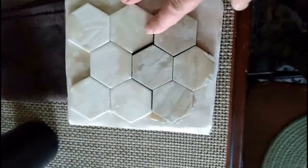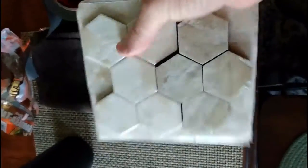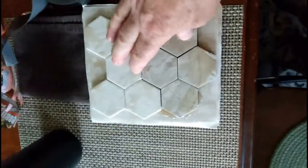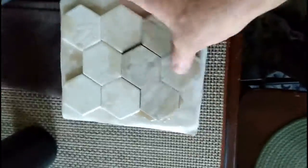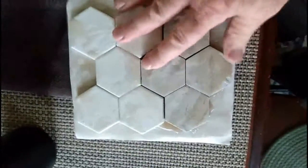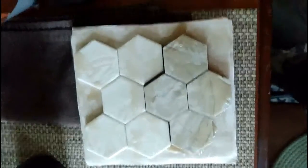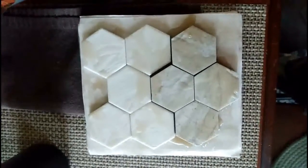So here it is. This test plate now has 45 layers of ultra-high molecular weight polyethylene sheeting on it, and I've attached two sets of tile for test purposes. The top one is 6-millimeter thick ceramic tile, and these are 8-millimeter thick. They're also soaked well in fiberglass resin to try and keep the whole thing solid and together. I'm now going to wrap this whole thing up really well with gorilla tape, and that'll act as my anti-spall, hopefully to keep the whole thing together long enough for me to put a few rounds into it.